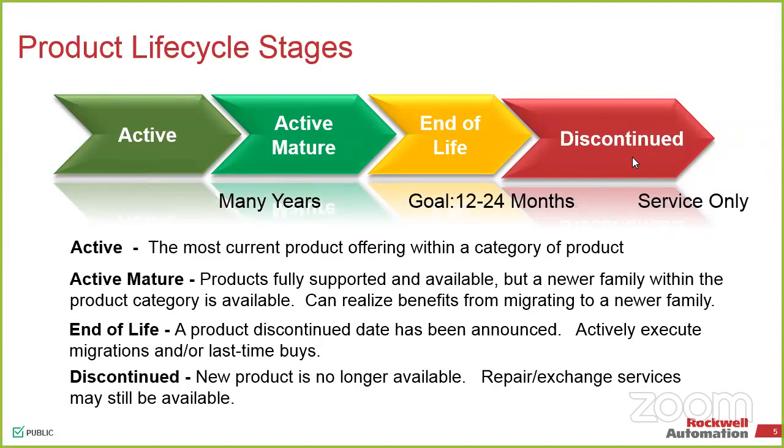And just to add on top of what Joe said, our repair exchange services, and this is specifically for the PLC5 because there's so many out there. We get people inquiring about new PLC5 cards all the time. We obviously don't have them. Rockwell will not sell you a refurbished PLC5 card. Where I'm going with this is don't throw away your defective PLC5 cards. Use those for repair exchange. You send Rockwell the old one, they send you a refurbished one. Half the price of generally getting it repaired. And it's also a lot faster because generally that can be done in an overnight fashion.